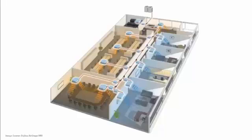Each zone can be individually controlled, and if one cassette breaks then the rest of the system can continue to run unaffected. When installing these systems, you need to pay attention to the zoning you're setting up, because if you've got two cassettes in one area classed as different zones, there's potential they'll fight each other — one calling for cooling and the other calling for heating at the same time. We'll look at some of these technical details in later videos in this series on VRF units.